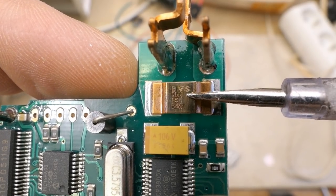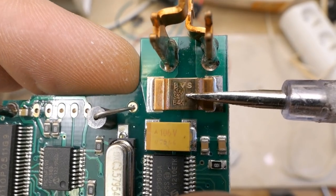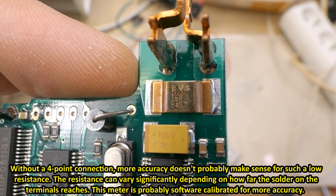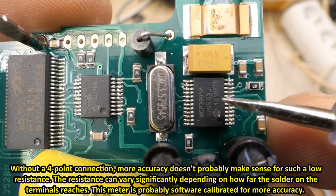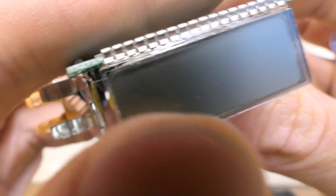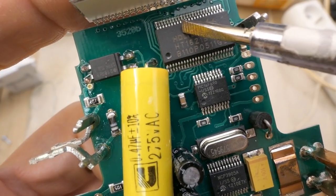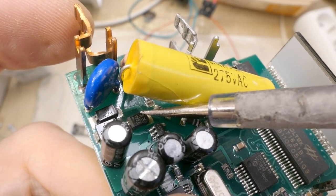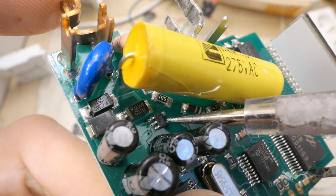It seems to say R001 — 0.001 ohms or 1mΩ, 5% tolerance. I'd expect more accuracy for this purpose, but it might be somehow software-calibrated in production. Here you can see the chips and the LCD display going to the chips — probably mostly this one. Under the capacitor there are a couple more components: some resistors, a diode, another diode or three diodes, and a 5-pin chip.